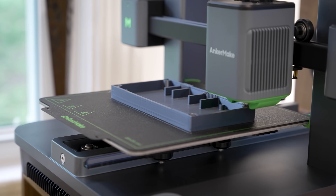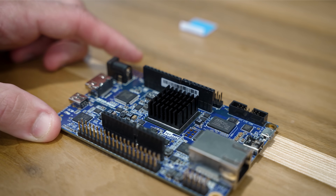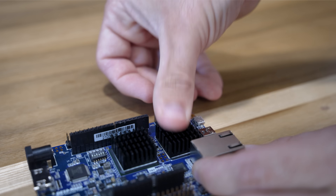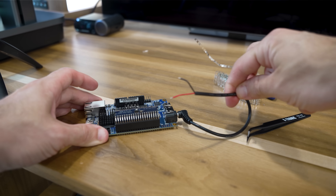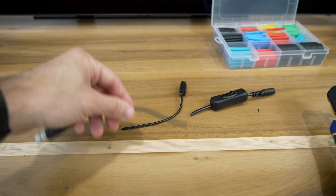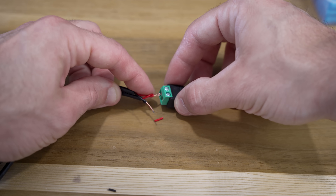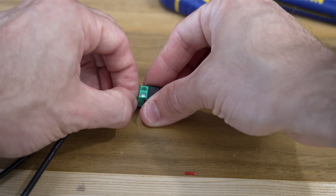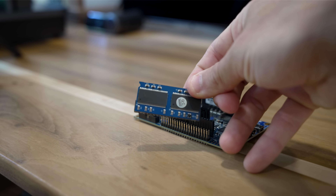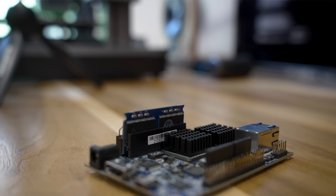The first job was beefing up the cooling of the DE10. Yes, we've added two fans, but those fans aren't going to be pointed directly at the chips. So I opted to add little aluminum heat sinks as well — they'll pull heat up and away from the chips and give more surface area for the flowing air to remove heat. This will ensure everything stays nice and cool even during long gaming sessions. Next, I had to solve the problem of power delivery. The DE10 Nano is powered by a 5-volt DC barrel plug, and the integrated USB hub is powered by a 5-volt USB plug. They also happen to be located in a really awkward spot at the top of the board. My solution is to reroute them to the backside of the case by wiring them both to a generic barrel plug adapter from Amazon. And I also had to perform a RAM upgrade. In order to unlock more advanced emulation on this board, it's recommended that you install at least one of these 128 megabyte modules of RAM — and no, that wasn't a slip of the tongue. I actually meant to say megabytes. This is retro gaming after all.